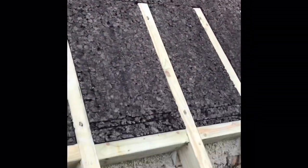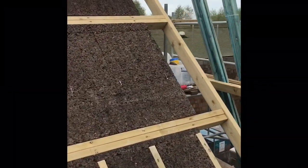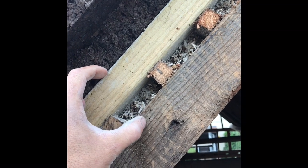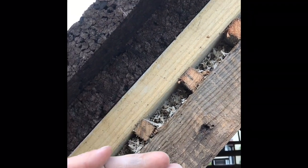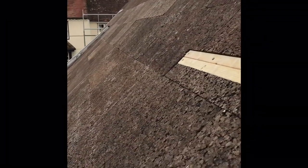You can see now how the little sprockets work, same on the ends with the gable rafter. If I take you around here you can see the layers: you've got the old rafter, the old tile battens, the hemp clay layer, then just a batten, and then two layers of cork board overlapped. The wall is going to come up to the underside of that — nice and toasty. I'm going to felt and batten it now.